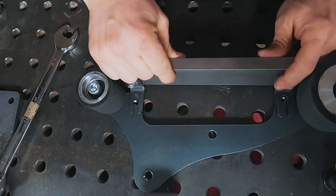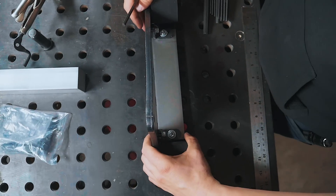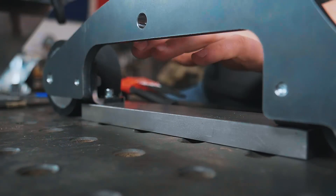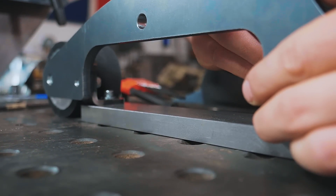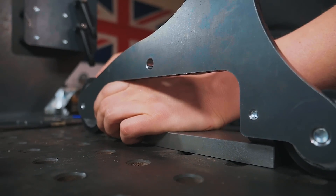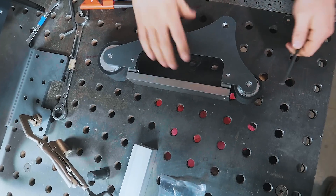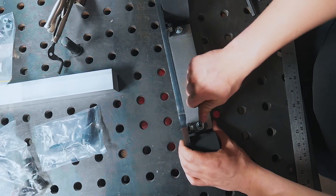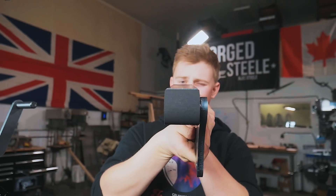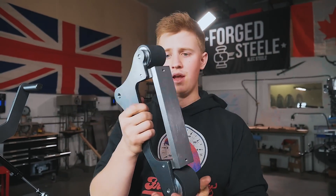Get these snugged down just finger-tight on a flat surface — we're making sure the platen lines up flat with the wheels. I like to raise it up just a skosh so the platen sticks out slightly, meaning no slack belt on the platen; when I make contact, I'm actually contacting. We still have side-to-side play because we haven't snugged that side down yet — that comes from tilting the platen sideways against a flat reference surface. You can make these adjustments later when you've got a belt on and can run it. The platen should stick out just a hair over the contact wheels, and side to side it should be lined up nicely.